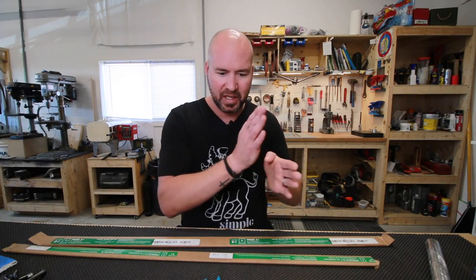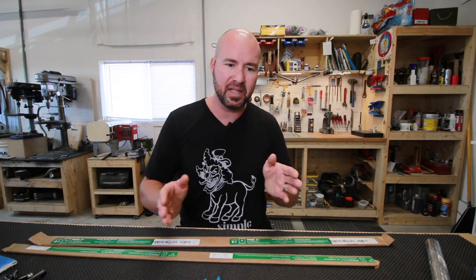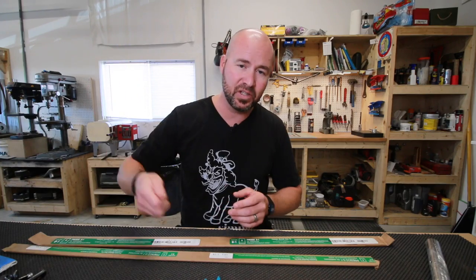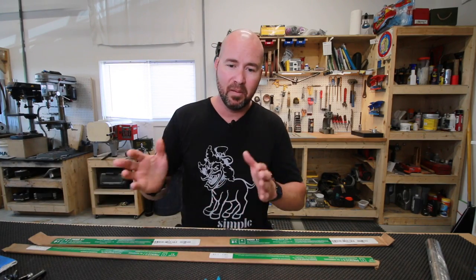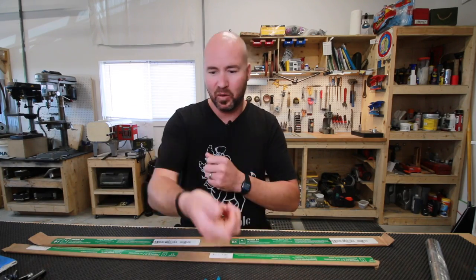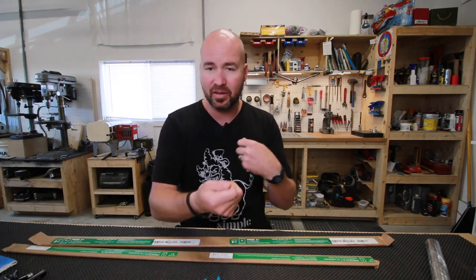I've seen guys that will do a bunch of carbon blades and then stainless blades, and they'll get the 1500, they'll do their oil quench on their carbon blades and then just ramp up to 2000 degrees for their stainless blades and then quench them there. But those stainless blades aren't in an envelope. So now they're introducing fresh oxygen every time they open it and close it. You know, they pull one blade out, do this, and then pull another. I really don't care what anybody says. They are going to get some decarburization.